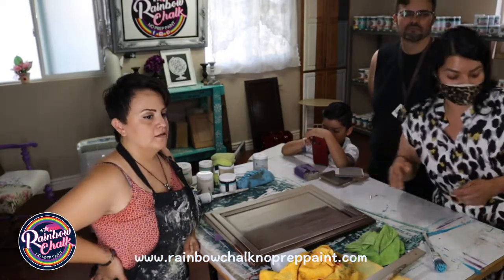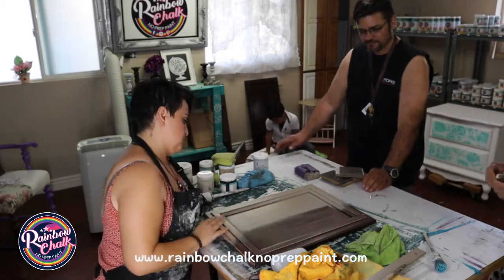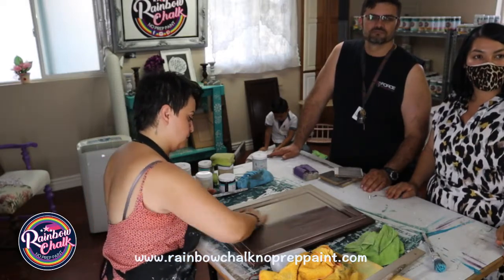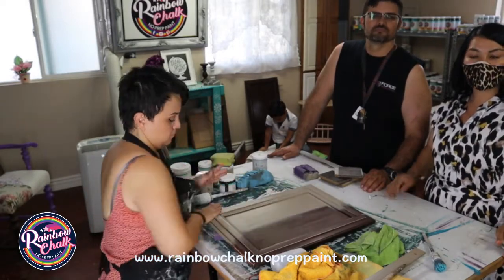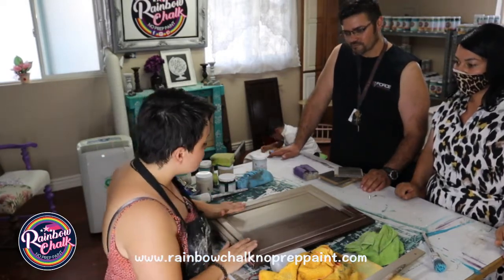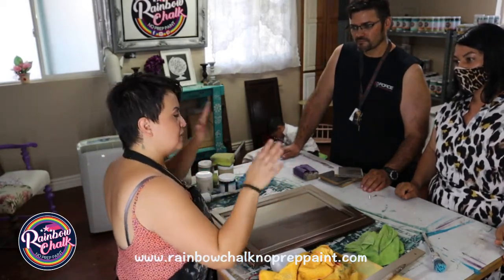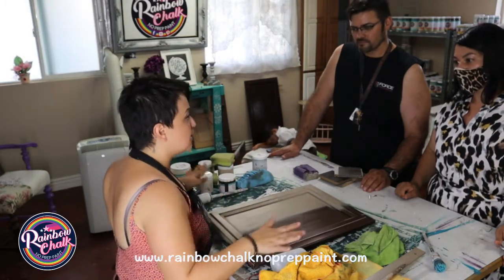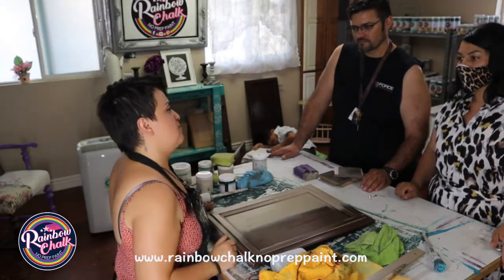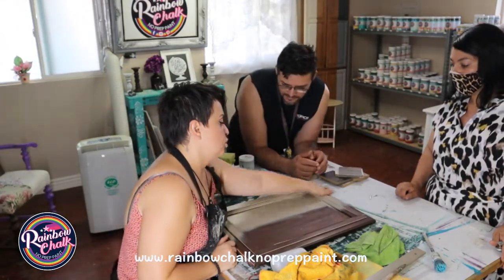Watch, touch it and it's hard. The top is hard. So it gets damaged super fast. If you leave it sitting out for 5 minutes, then it'll start getting like that, and then it won't work because it doesn't leave a soft finish. And now because it's drying, it doesn't mean that it's cured, so don't come in and mess with it. Allow it to dry at least 24 hours on your last clear coat. Let them sit for 24 hours, then come the next morning and start putting them up. It's really good to give it its time to cure.